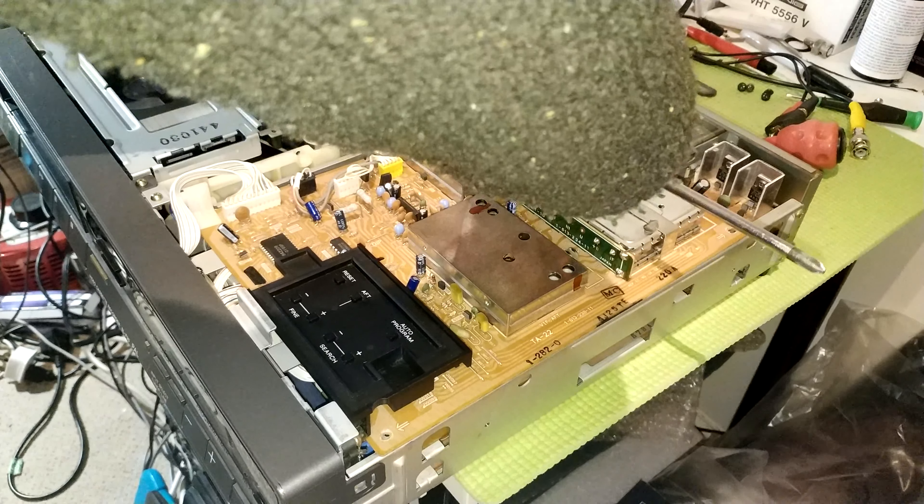It's not the way I like to do things — I prefer to find out why something is causing an issue — but it's a tuning section, so I'm happy to go with the board replacement. In this case it makes very little difference; all I actually want to do is select the AV-in, and the tuning section is pretty much redundant anyway. Maybe in a future video we'll look at why these keep failing — this is the third out of probably a hundred or so machines I've looked at. They're dealing with quite high voltage too, around 33 volts for the tuning. Thank you very much for watching, and see you in the next video — bye for now!